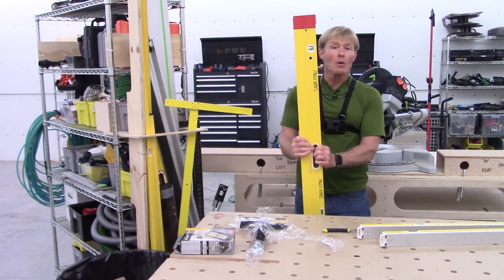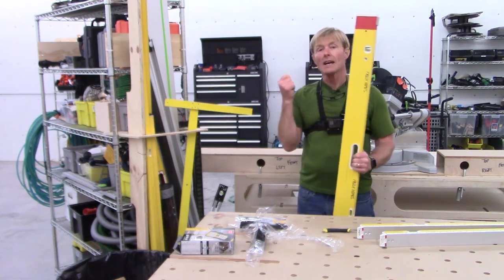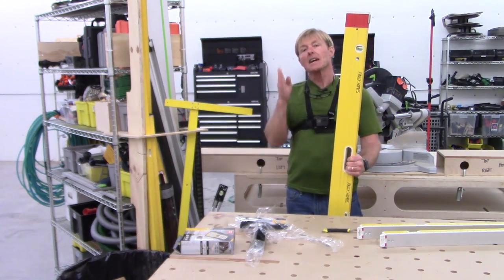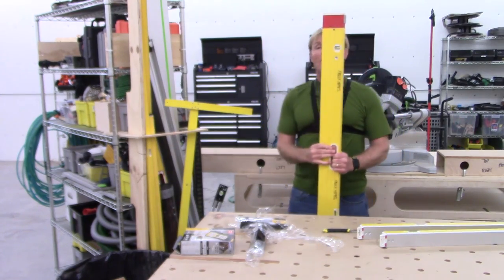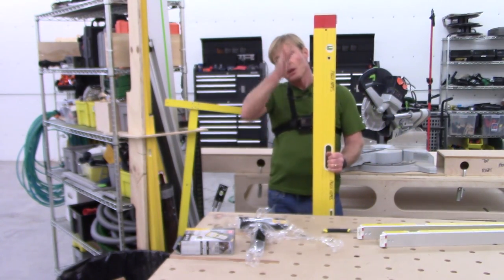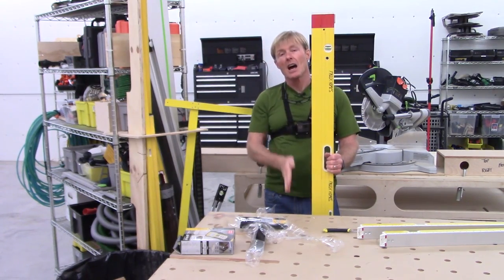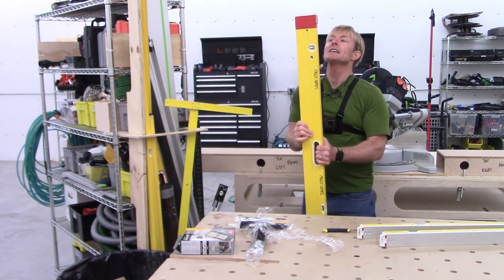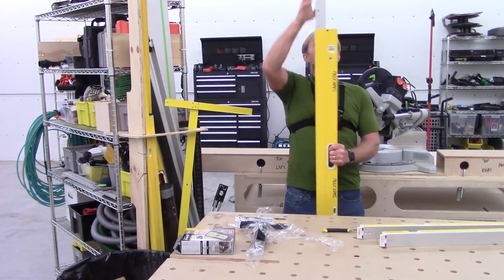When I'm framing, walls are typically nine feet, sometimes ten feet — rarely eight. You want to plumb a wall plate to plate; you don't want to put a level on a stud. Studs have a crown to them, and if you're framing properly you've crowned them all one way. You want the plate plumb — from the edge of the plate to the edge of the plate, you want that line plumb.